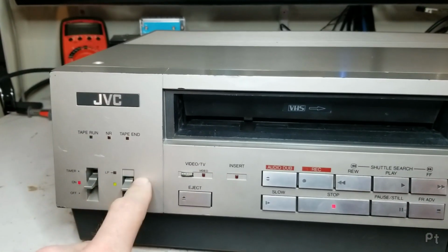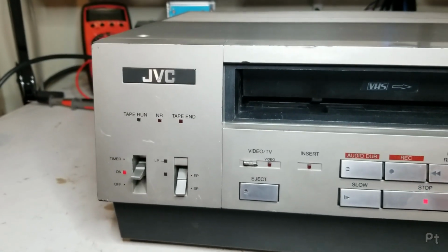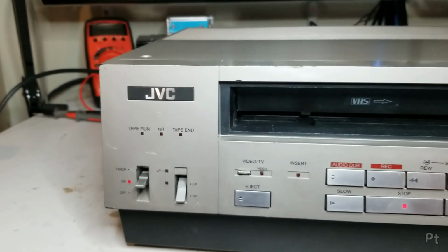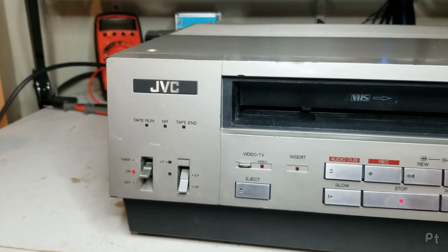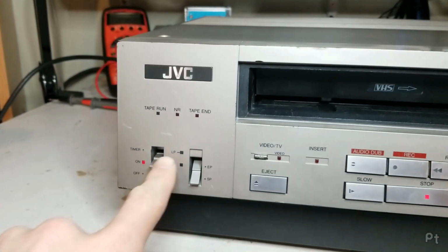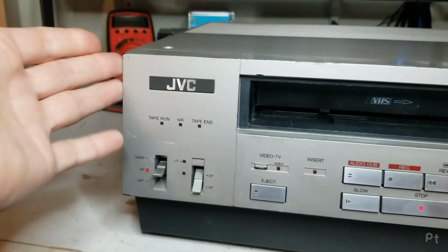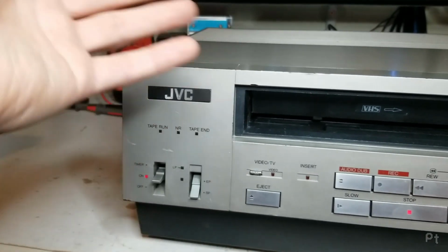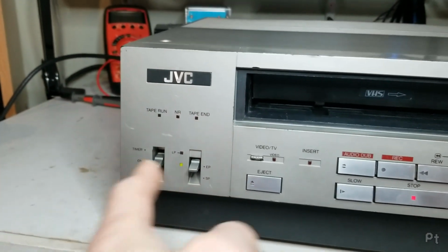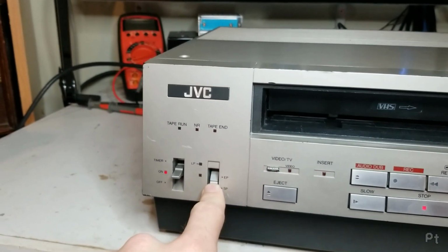And I kind of agree with that, because all the times in the past when I tried to record with LP, thinking, oh, I get better picture quality than EP, but I can still fit more than SP, the quality difference was minor. And it really depends on the VCR that you're playing it back on. LP's kind of a bit of an oddball. But yeah, the JVC standard and all the VCR manufacturers that followed them, 2 speeds. Panasonic supported LP, I think even into the 2000s on some models. At the very least, the late 90s.